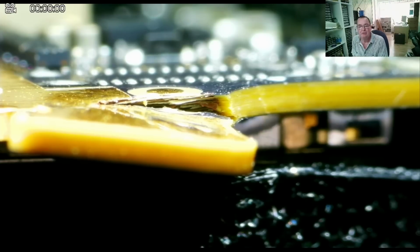Well, guys, I've got it under the other microscope. I'm using a soldering aid just to hold it in place and keep it still. At this magnification, if I even touch the desk or breathe on it, it's going to shake around. But I'm sure you can see clearly inside that there are multiple inner layers, down in there. And the problem is that if two of those are touching, if it's a power plane, there may be even more than one voltage power plane in there, and ground, then it's going to stop working, even if it was working. We take this piece of board off and hope for the best. There's nowhere to mount the heatsink, so unless anybody has any really clever ideas, we aren't going to be able to fix this one, which is a shame.